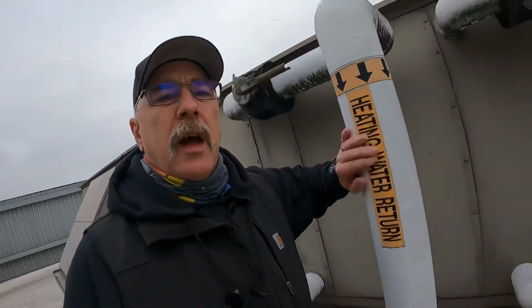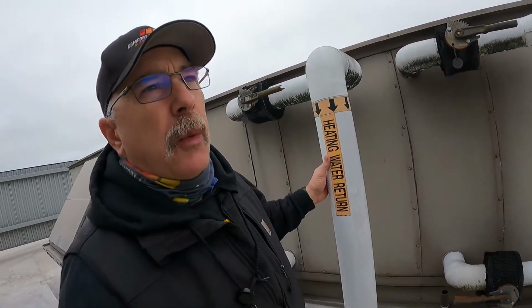And on this particular building, we're not only doing our comfort cooling, but we're also doing our heating via the hot water coils, which are getting hot water from a set of boilers down in the boiler room that in the wintertime, like it is right now, if spaces want heat instead of cooling, the boilers are running, giving us some hot water, and we put heat in it that way. We still have individual terminal units that have electric resistance heat for individual spaces, but the building as a whole, for morning warm-up and whatnot, we can run the hot water coils, and that will give us our heat.